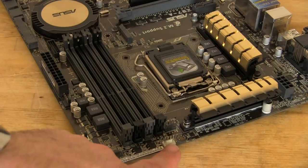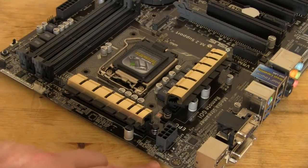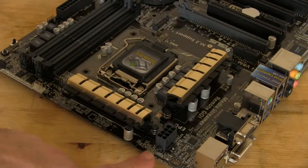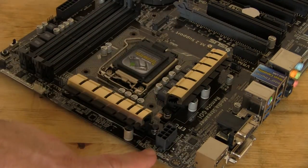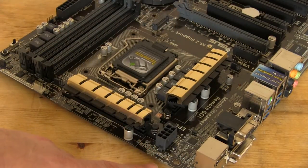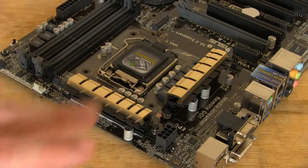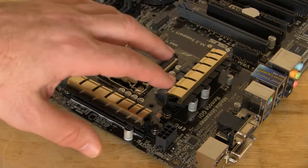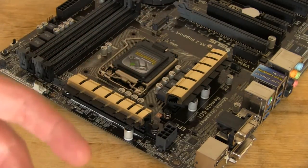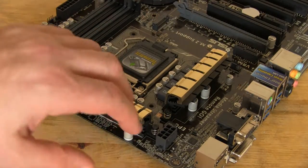There's another 4-pin PWM header for the CPU fan. Moving around, one thing to specifically point out is the amount of clearance for the 8-pin AUX power header. This is one of the first times we've seen any motherboard manufacturer give you that much clearance there. We like that — it's a great departure from design. Most of the time these are right up against everything and you lose a little knuckle skin. We still recommend getting an adapter; a nice sleeved one will make your case look a little cleaner.